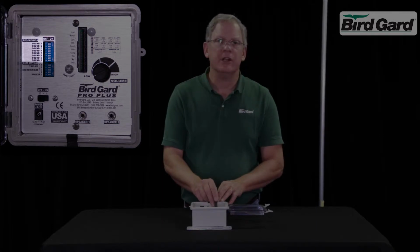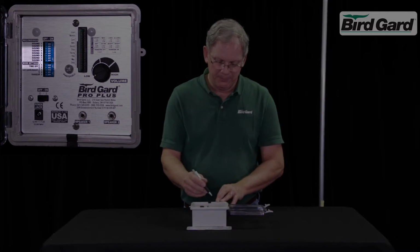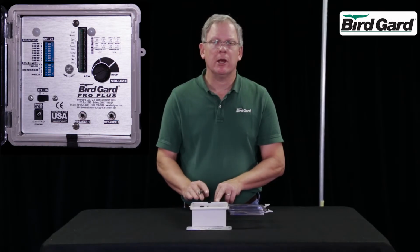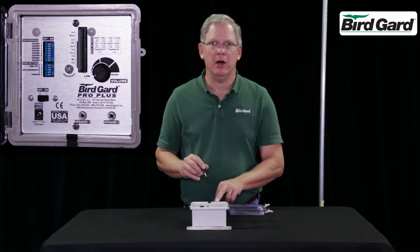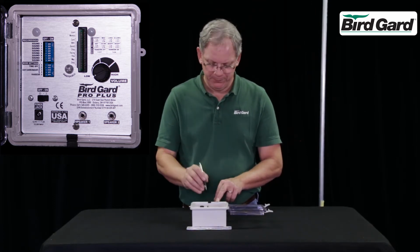To the right is in the on position. To turn one off, simply move it over. The bottom 5 switches are the mode settings. They include the time off interval, the daytime operation, and the random switch. Your unit comes preset for the shortest time off interval, daytime use, and the random is turned on. This is the best setting for most every application.